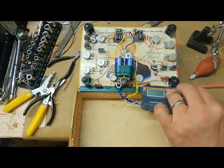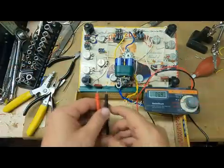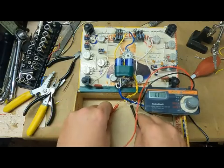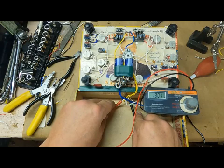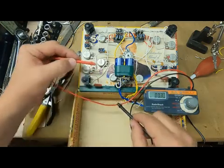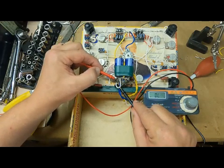I've messed up the power supply about 3 or 4 times now. I have the diodes in backwards. I tried to fix that, and I had a floating ground. Alright, so now that all that's fixed, input voltage, 13 volts AC. Alright, well that's good. Once again, on the other side of this second transformer, it should be boosted back up close to 100. This is only 95.